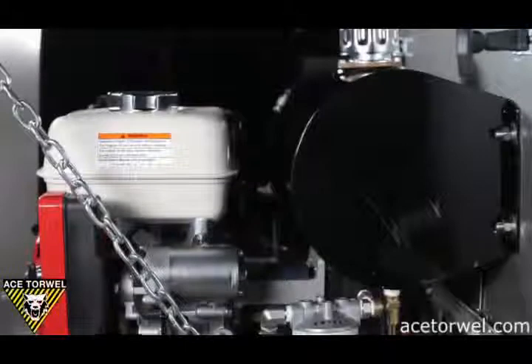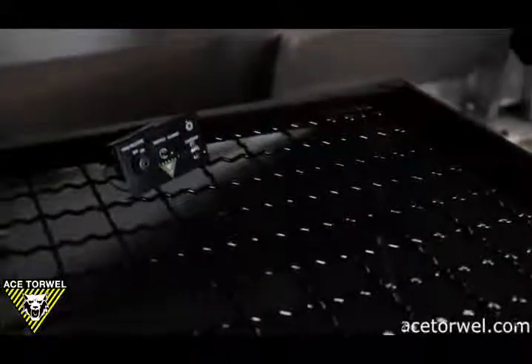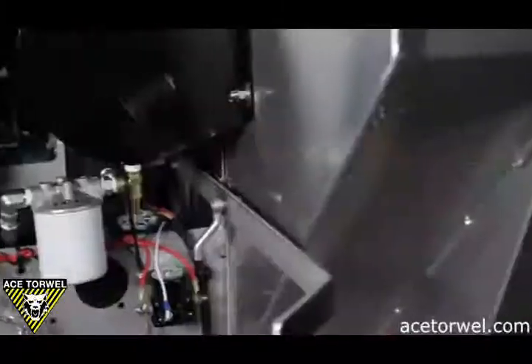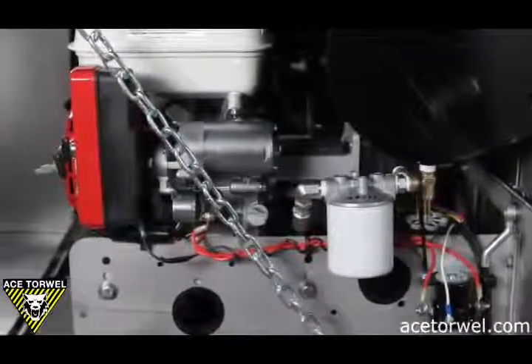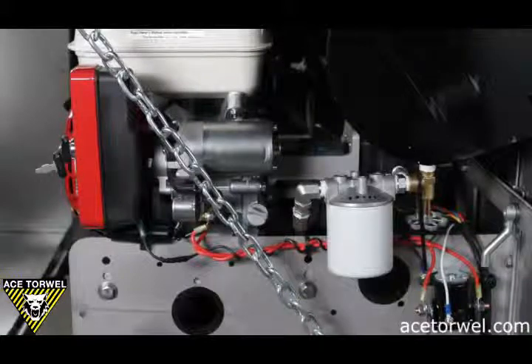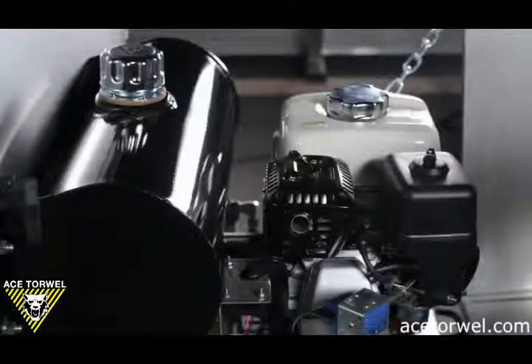This is our economizer gas over hydraulic powered system. It's powered by a five and a half horsepower Honda motor, which is electric start — all controlled from inside the cab. You can start, choke, throttle up and down, and start the conveyor and turn it off right from inside the cab. It is a pump-driven hydraulic system that delivers to two hydraulic motors — one for the spinner and one for the conveyor. There is a feature that throttles the engine up and down, giving you more volume or less volume as you speed the motor up or slow it down. Proven for 1.3 yards up to 3.9 yards in capacity.